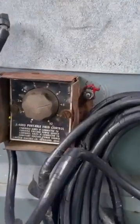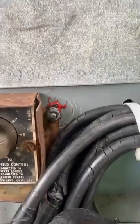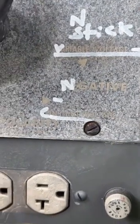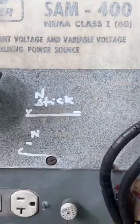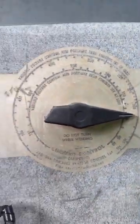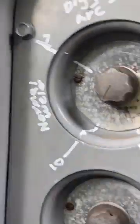I was thinking about cutting it short but instead I fixed it on the inside to make sure the cables don't have any shorts. Made two holes — five-sixteenths each side — put red glue since this thing might be vibrating while it's running. Made two more holes — three-eighths — bottom and back, just to put the tie wrap. Marked it negative. The bottom is constant and variable is what we're looking for. This is stick, and it's more clarified — the amps go up to seven, three and a half, and then normal and special weld.